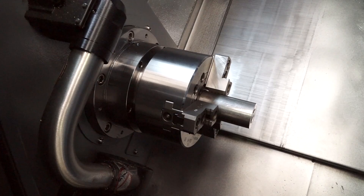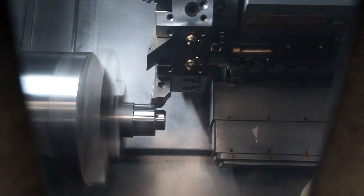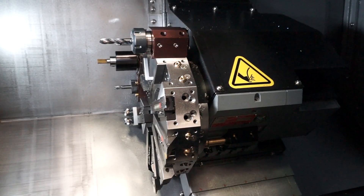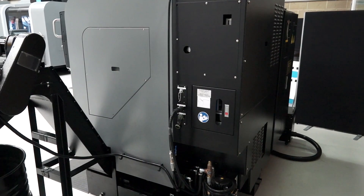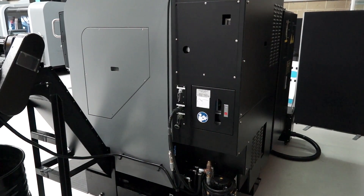This is the TM6i, it's our entry level CNC centre lathe. It has a 6 inch chuck, a maximum RPM of 6000, and a 12 station tool turret. We have two types of turret: a slotted turret and a VDI turret. You can put 45mm up the spindle, and you have two different diameters — on the VDI there's a maximum of 215mm diameter, and on the slotted turret you have 315mm maximum turning diameter.